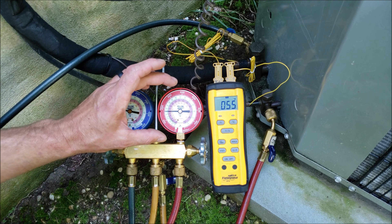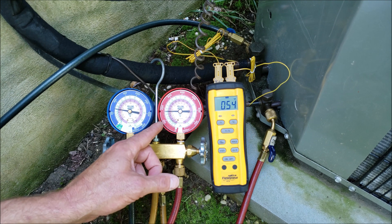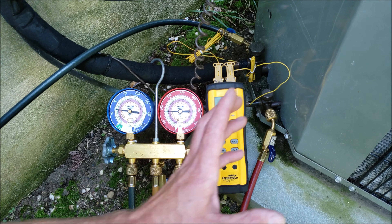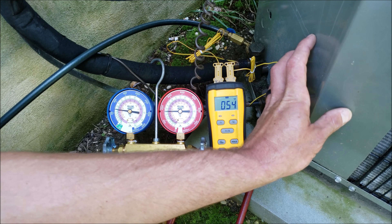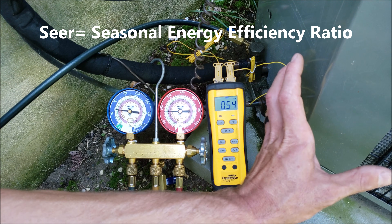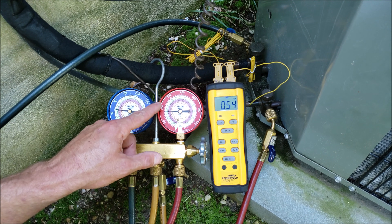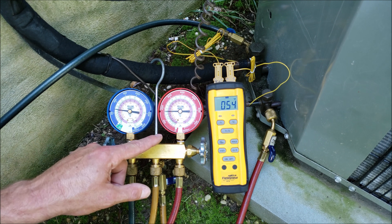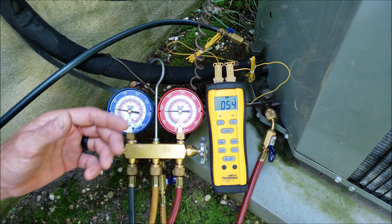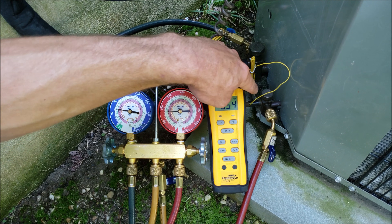Another example: if you tried to set the outdoor pressure at a certain point, the issue is this high side pressure may be higher if the fins are deteriorated. Or if this is a lower SEER unit — that's the seasonal energy efficiency rating — if the size of the coils out here is smaller, it's going to have a lower SEER rating and a higher pressure. So you can't just set these at a certain pressure based on your prior experience. You really need to check your subcooling on this gauge and with this line.